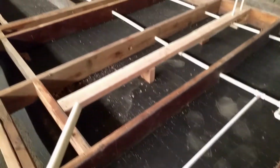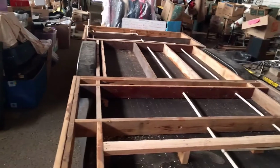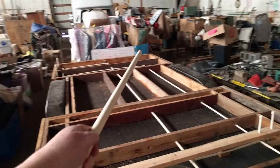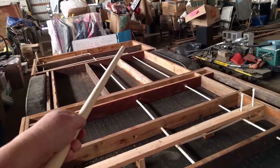And I also will, this liner I have in here, the felt paper under here, I'm going to be picking that up and stapling it up into place too, and putting the 2 pieces of plywood under there. And once I get this thing all wired up, what I'm basically going to do is run the circuits from up here where the electrical box is going to be. I'm going to run 4 circuits in. I'm going to do one for the kitchen, one over here for the water heater, so there'll be 2 lines running over here. I'm going to put an outside plug out here on the back, and I'm going to wire that in, and that's going to be on its own.